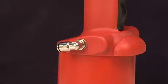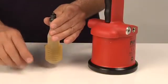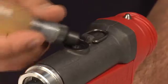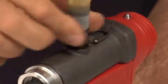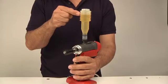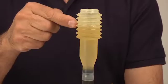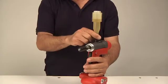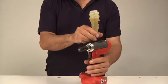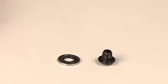Supply the machine with compressed air, pressure must be equal to 6/7 bar. Tighten the supplied bellow container onto the plug seat, with the riveting tool in a vertical position and in pause. Press the tensile strength button, to allow the riveting tool to run a few cycles until the bellow container stops emitting air bubbles. This condition means that oil refill inside the cylinder is complete. With the riveting tool always in a vertical position and in pause, loosen the bellow container and close it.